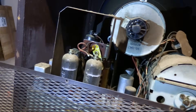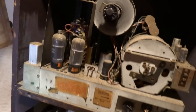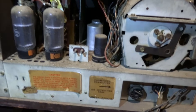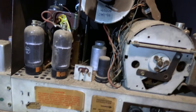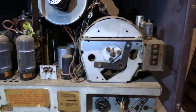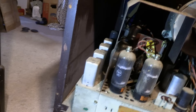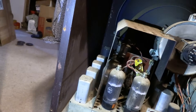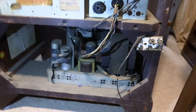High voltage is a bit different — this has two 6BG6s driving the flyback. There's that non-standard AC power cord, which apparently is polarized. It has the same trio of electrolytics down below the CRT neck. The IF is different though; the other set had it all crammed up towards the front curved under the picture tube, but here it's all along the side. I imagine they had a little more room to play with because the power supply is down below.